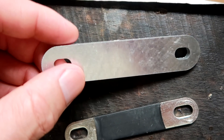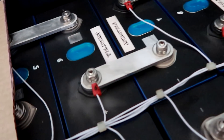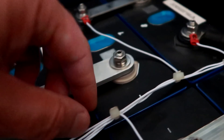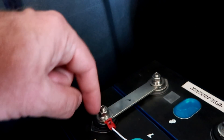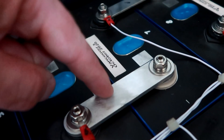I'm really keen to put them on. I have mounted two of them already on one of the cells which had voltage drop all the time - I had to undo the screw a little bit and then tighten it again. There is a contact issue somewhere. I cleaned this all up, cleaned up the grease underneath, and cleaned up the contacts with alcohol again. I have mounted two of these aluminum bus bars already on battery number six. They do a perfect fit around the terminals on both sides and I still have the gap in between. The original ones are always a bit short - if you stretch them apart when you have a gap, they are not covering the whole terminal anymore because they are a little bit too short. These ones do.